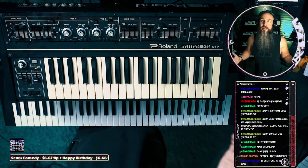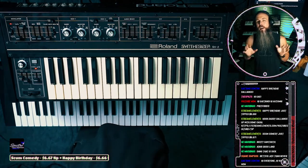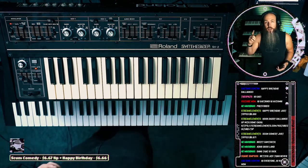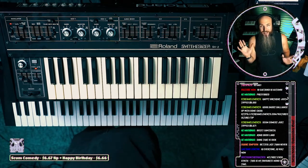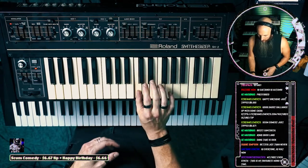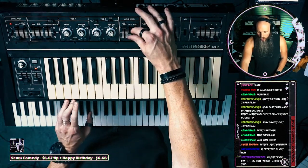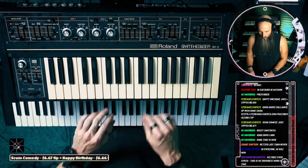A sub-oscillator is a cheap way to add more thickness to a sound. I say cheap from a component's perspective. They don't have to implement an entire oscillator. What they actually do is that every time the oscillator finishes a cycle, the sub-oscillator goes up or down. That's all it does. And what that ends up creating is a square wave. So it's a square wave an octave down from VCO1. And we can get really deep in here. And so all of these together is an incredibly thick sound that was not possible with something like an SH-101.